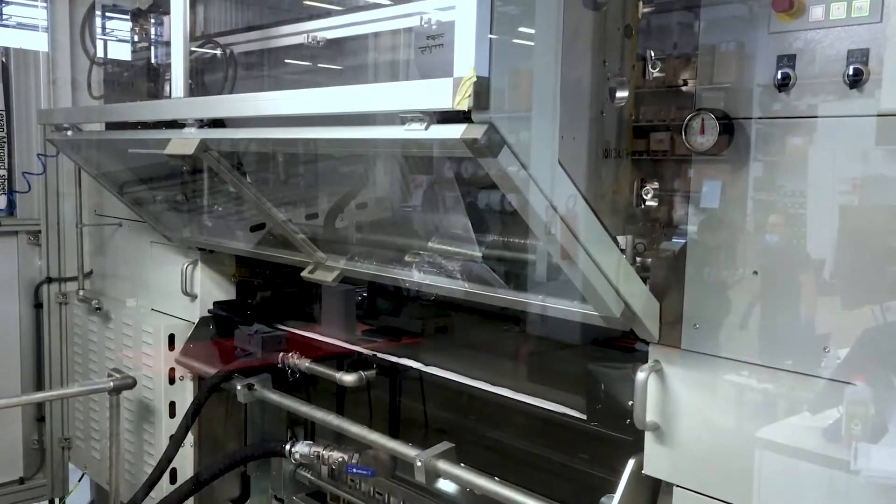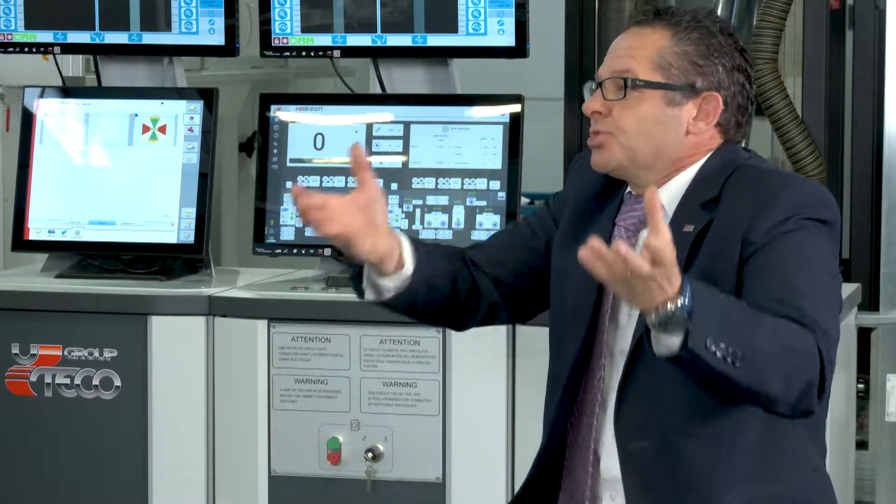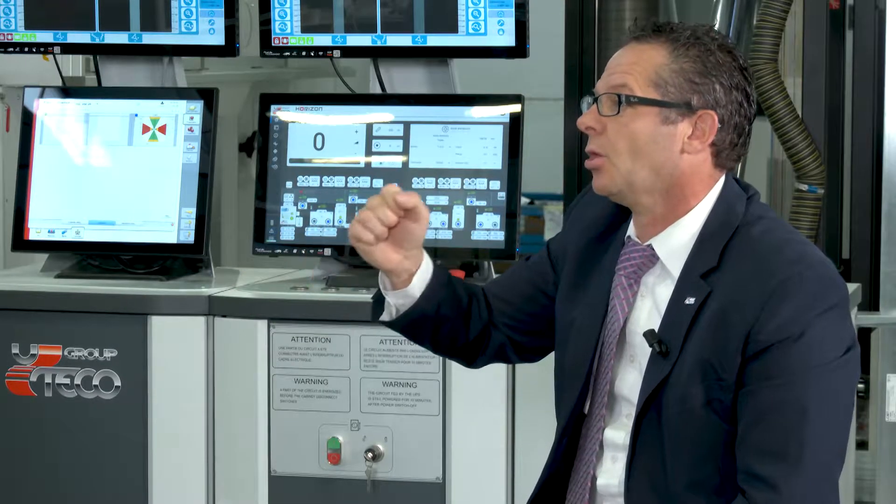You mentioned the trolley — so how exactly do these trolleys work? The operator will position the trolley properly into the gravure station. From there, an automatic engagement system is activated, and it automatically lifts the trolley into position. This trolley now becomes part of the machine frame — a solid piece of structure for stability. The machine is also equipped with tool-less operations for easier, safer, and faster setup for operators. All of these features provide advantages including stability of the process, running with low-density polyethylenes, and quicker changeovers.